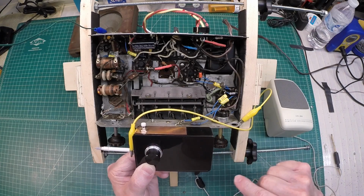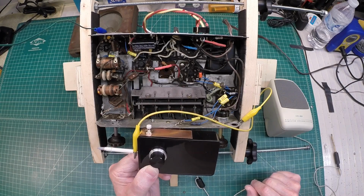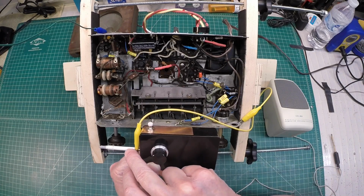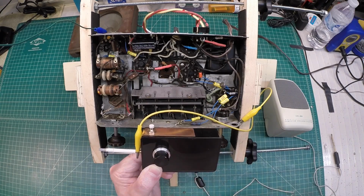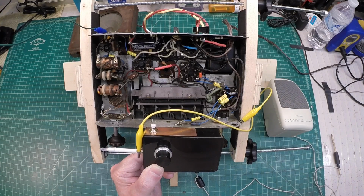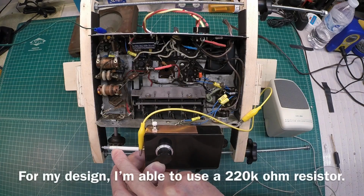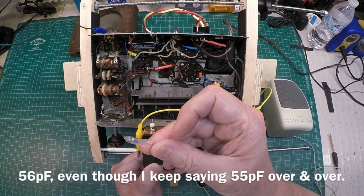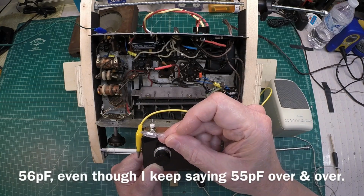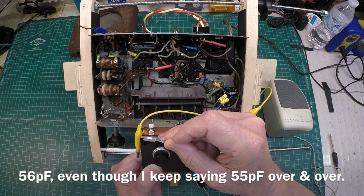Anyway, I want to go ahead and get started here on the RF section. I'll walk you through it and show the schematic as well, and I just want to point out a few things about how attaching the probe to different impedance points, that being the plate or the grid of the tubes, can impact the results of the signal tracer. So we'll use a high value resistor in addition to a picofarad value capacitor to mitigate some of those issues that you'll see.